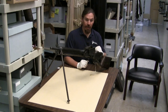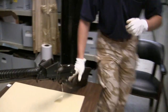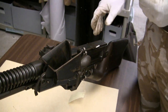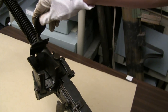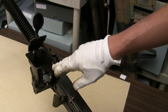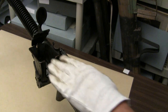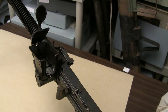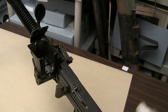Let's start by taking a look at the elephant in the room — this big, cool, interesting hopper on the gun. The idea with the Type 11 was that it would ease logistical issues by feeding from the exact same five-round stripper clips that Japanese riflemen used. They put this hopper on the side; there's a big spring-loaded top cover, and you'd put in six five-round clips of 6.5mm Japanese ammunition. The gun would feed through those clips, so you shoot 15 rounds, lift the top up, drop three more clips in, and keep shooting.